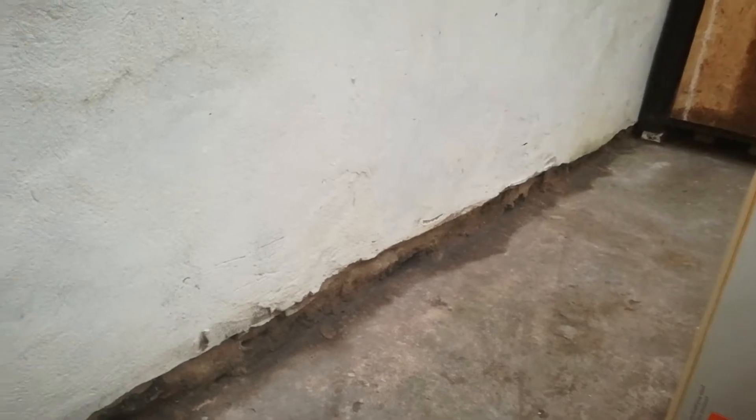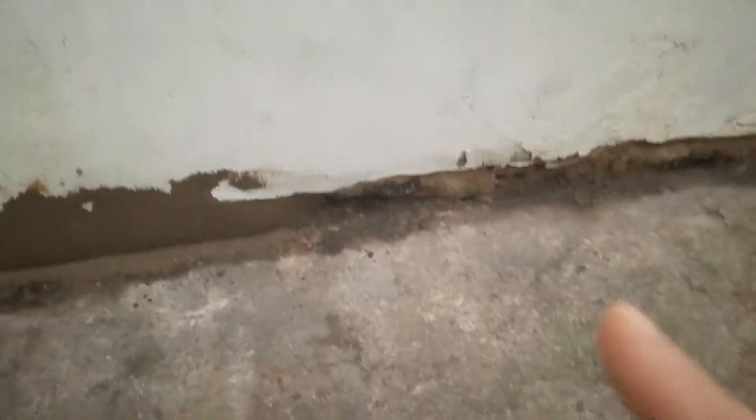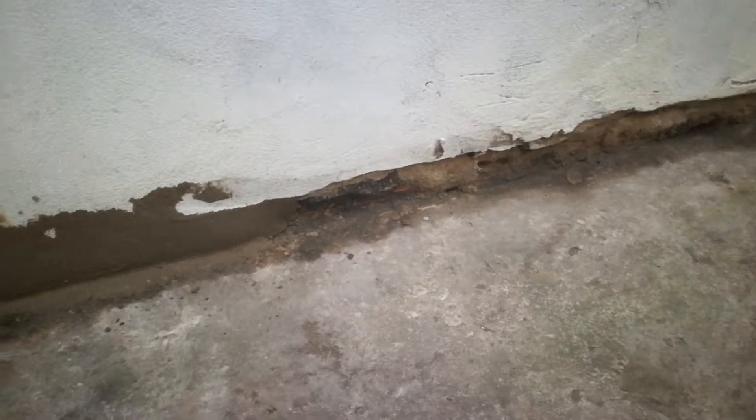Then you'll have a strong render. This is more like filling — this is not really rendering — but you know, you get the point. Anyhow, before that we applied waterproof liquid all the way along, again just to add as much barrier as possible. Although these walls have a cavity so that should be fine, but anyway, it doesn't harm, does it.